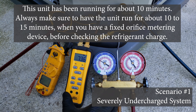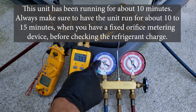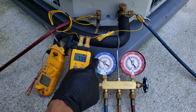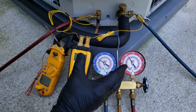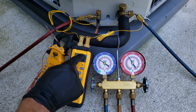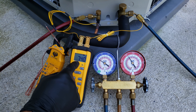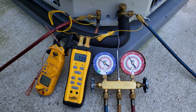This scenario is the severely undercharged scenario. You can tell right away by looking at the pressure, which is around 100 psi. Converting that to saturated temperature on the pink inner ring, you can see the saturated temperature is at or right below 32 degrees. This is measuring the saturated temperature at the indoor evaporator coil. If it's below 32 degrees it's going to be freezing any humidity in the air crossing that indoor coil — and that's a problem. On our suction line here, T2, we're measuring right on our large suction line — also referred to as the vapor line or low side line — and we read 74 degrees.